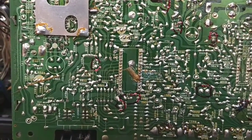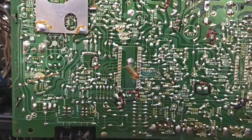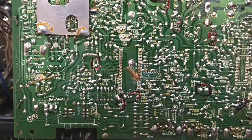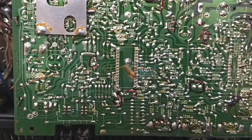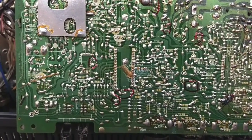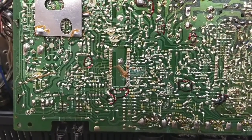We're going to get to desoldering this and then pop the new IC in. Normally I'd use a high-temperature broad-tip solder gun, but I don't want to overheat these foil traces because these boards are not known for stability. So we're just going to do it the old-fashioned way with a 60-watt iron and some solder wick and get it out and get the new one in.